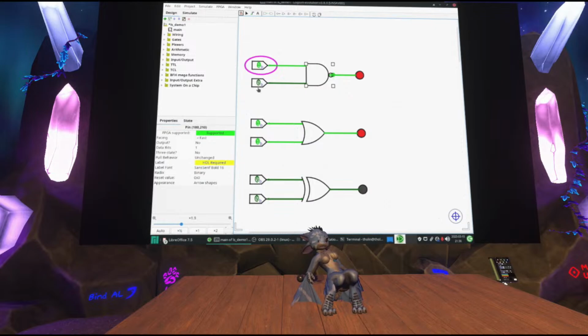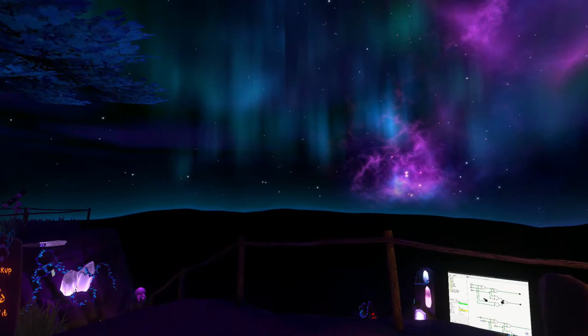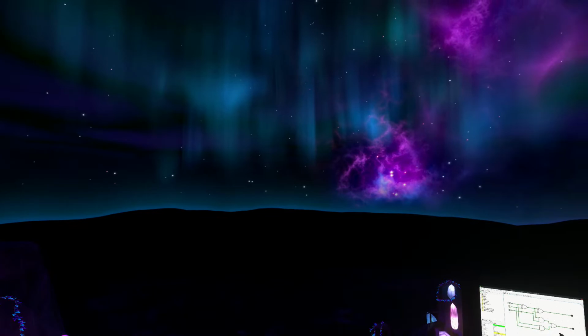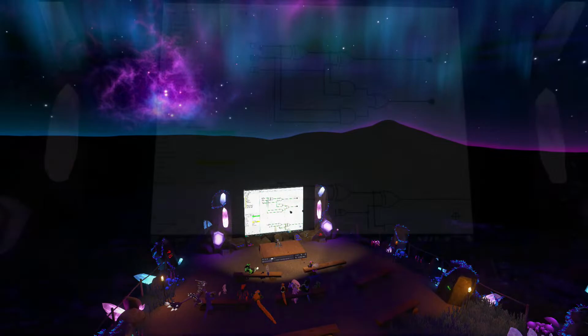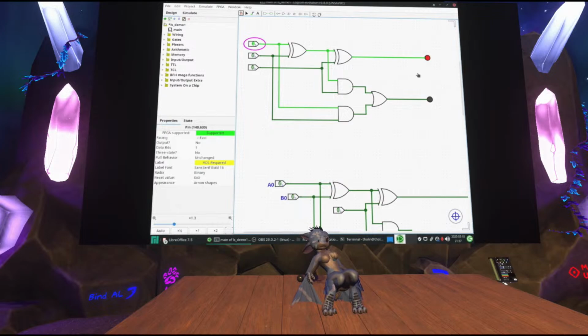And I can actually use these very simple functions to build more complex logic. So this down here, it's just using a handful of gates. It doesn't really look that complicated yet, but this is the minimum circuit that you need to be able to perform addition. So it has three inputs and two outputs, and this circuit will essentially compute the sum of all of these inputs, so A plus B plus C. So I put in a 1, for instance, it's going to calculate 1 plus 0 plus 0 for me, which is 1, which is 01 in binary. I can do this for any one of these. And of course, I can also input something like this, which is 0 plus 1 plus 1, which is 2 in binary, which is correct. Over here, 1, 0, that's 10 in binary. And if I turn on all 3, I get 3, which is 1, 1 in binary, which is correct.